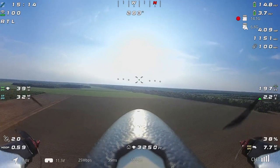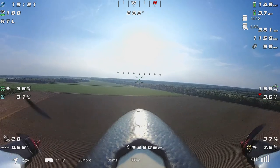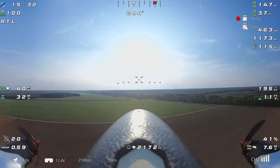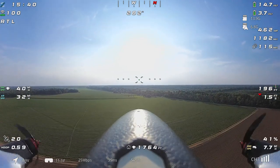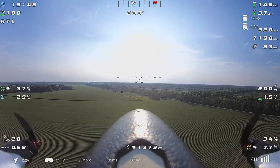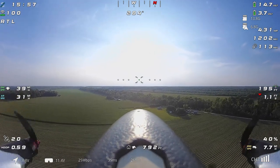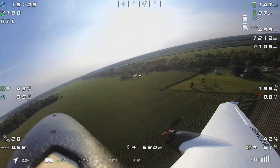Maybe one motor is pulling stronger than the other — like the left motor weak and the right motor stronger. I'm running D-Shot 600 on the ESCs, so I don't think it was an ESC calibration issue because with D-Shot there's no ESC calibration. There also shouldn't be anything related to differential thrust, because I don't have any of that set up. Both ESCs are plugged into separate servo outputs on the flight controller but both outputs are just mapped to basic throttle and receiving the same signal, so everything should be matched.